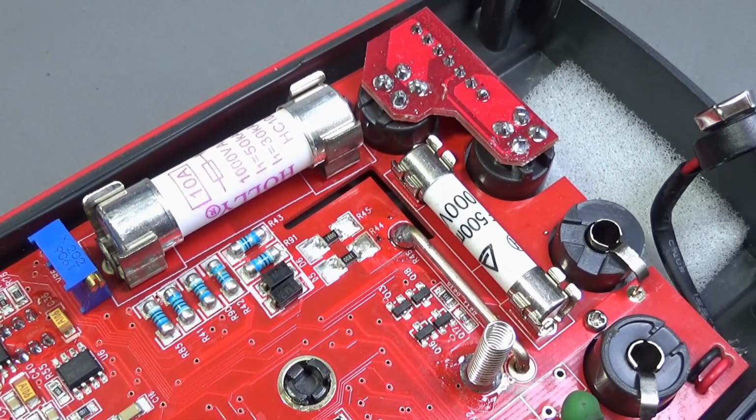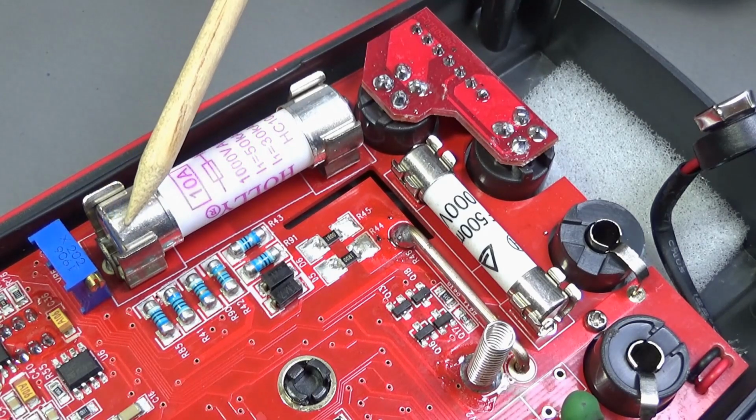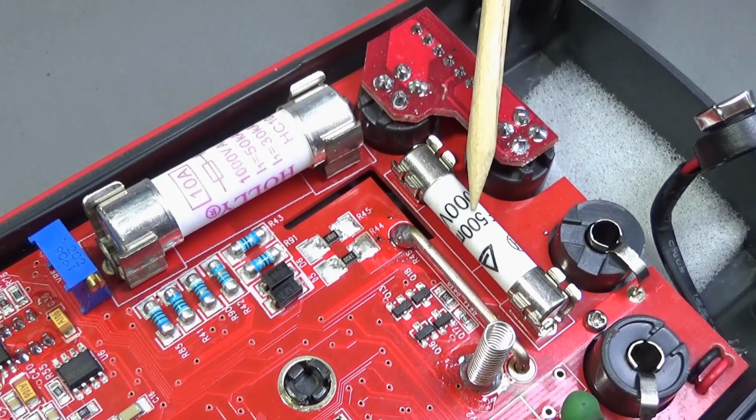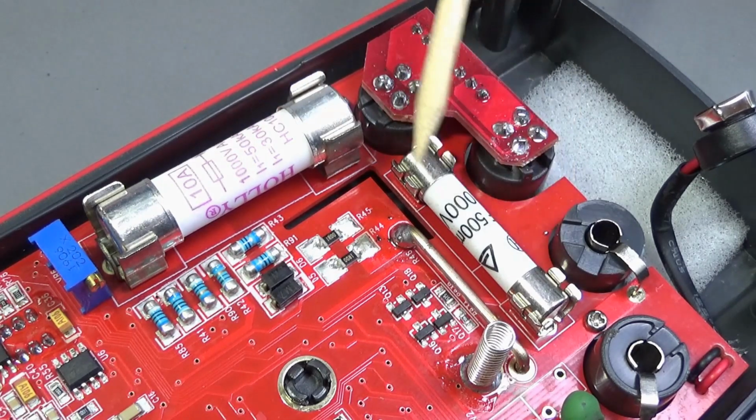Some people complain about the kind of fuses. Uni-T listened to their complaints and they changed the fuses. But guys, the fuse is something more related to what you are doing. As an example, I just told you, in my workbench, I work with 250 volts. So if I make a mistake, a fuse with a 1000 volt rating can last longer. So maybe I reconsider the 1000 volt fuse. Thanks Uni-T for it, but maybe I should switch to a lower rated fuse. That's my case, maybe not yours. Sometimes we have to customize to our needs.